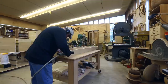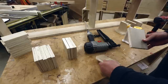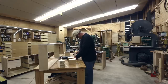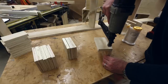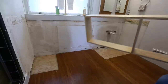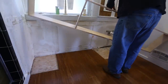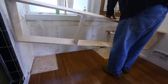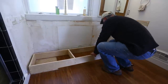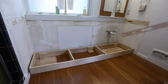I can just glue and nail them together through the dados. To hold the frame to the floor, I made some little L brackets out of the same pieces of wood — just took some ends and scrap pieces and made little L's. Those will sit on the floor and help hold the frame in place, and I can use them to help level the frame so I can make the top perfectly level. So there's how the L's go in place.